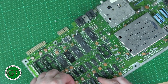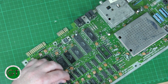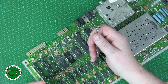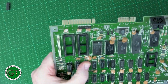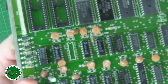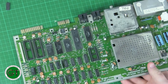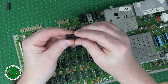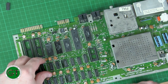Let's see if the chip will come free. There we go — and out she comes. Quick inspection of the board and it doesn't look like we've damaged any traces. What I'll do is pop in an IC socket so that if it ever needs replacing again, we can just pop in a new chip.